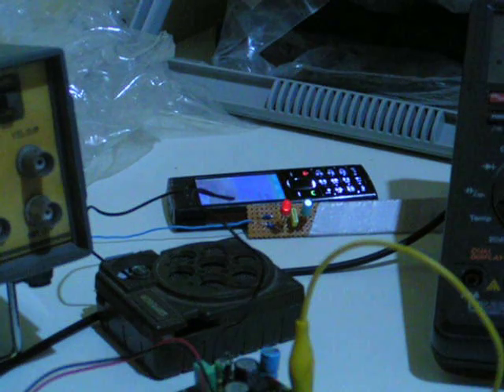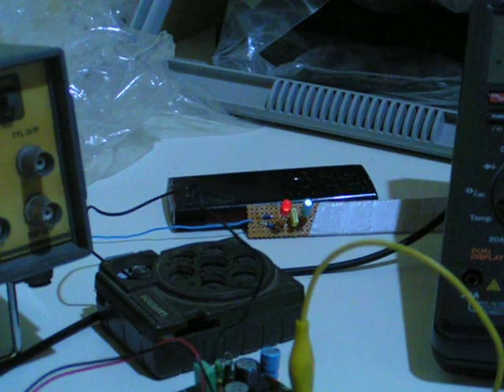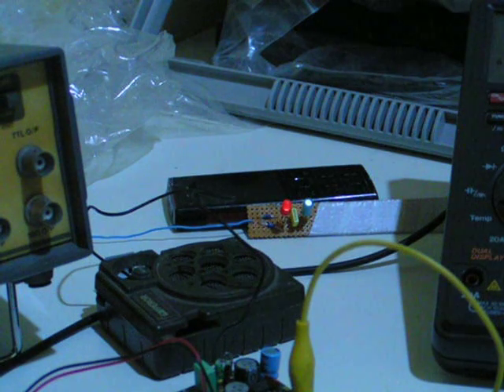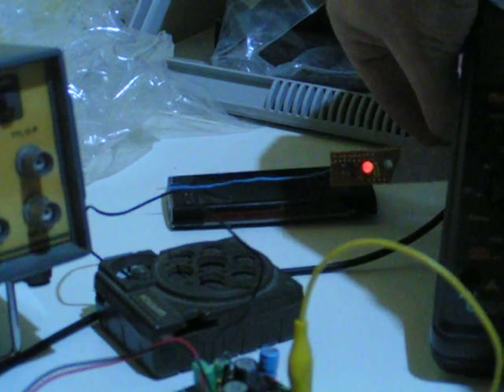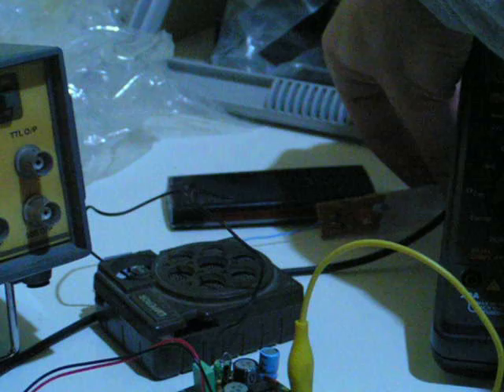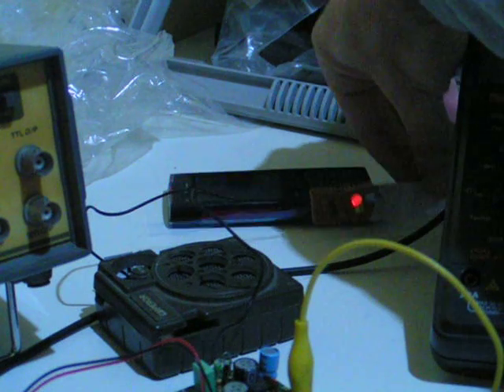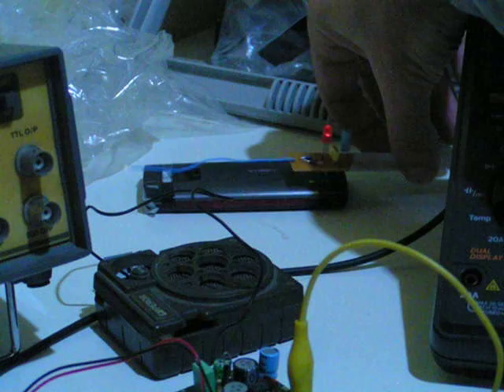You can see the LED is turning on. What actually happens is that the electromagnetic radiation from the mobile phone is coupled through the wire into the circuit, which provides rectification. This rectification outputs a DC voltage — it's not constant, but it's DC — which turns on the LED as you can see. Depending on where I put the detector, I get different signal strength. I noticed that my mobile phone has stronger radiation at the bottom, because I believe the antenna is located at that point.